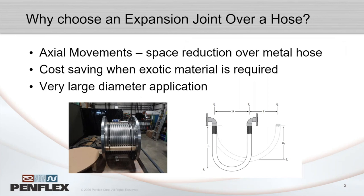The biggest benefit of a metal expansion joint is axial movement. Braided metal hose cannot be compressed or extended because of the braid. You can use metal hose in a loop to accommodate axial movement — if one end is fixed, the other end can move left or right — but an expansion joint can be put inline with the pipe and accommodate the movement in a much more straightforward way, without the big U-shape to worry about.